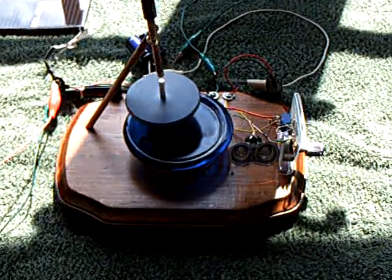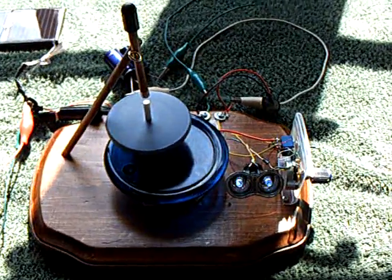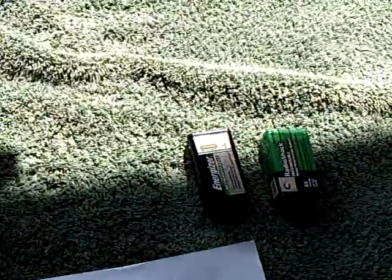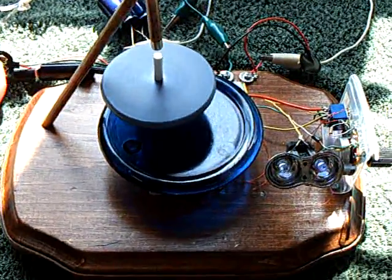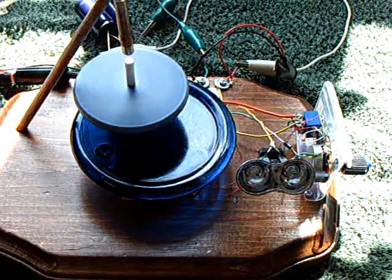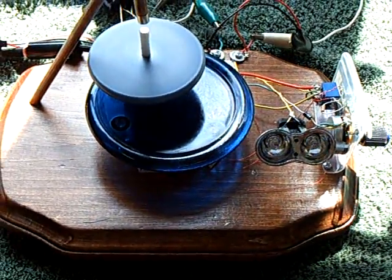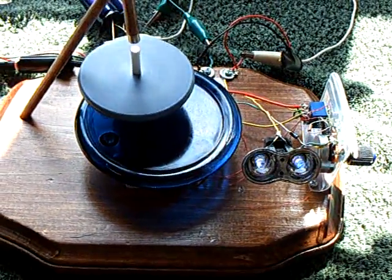Here's my top charger, all done. I did quite a bit of testing on it yesterday using capacitors — I pulled the batteries out to see what the circuit would do, because capacitors let you really tell the efficiency. This will run anywhere from three and a half volts on up, and at three and a half volts it stops. The amp draw at the low setting was about five milliamps, which I was happy to see.